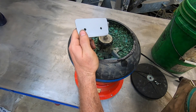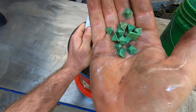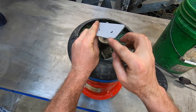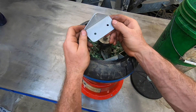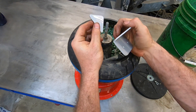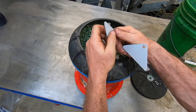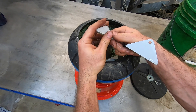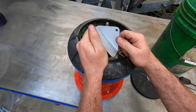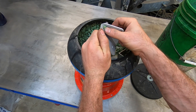I can wash them. By the way, the media also cleaned up — it got all dirty and lost its green color while rubbing on rusty steel bolts, but now it has a light green color. The parts are deburred; this bracket in particular I left all of the burrs from the belt sander. There is a pretty attractive matte finish. There are still some imperfections because these were spacers for a woodwork installation, but it looks quite good. The only area it didn't do is right in the corner, but the pyramids could never get in there.